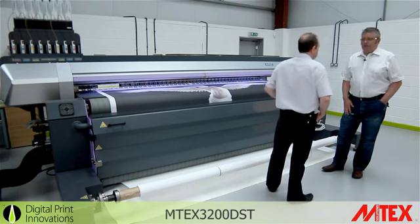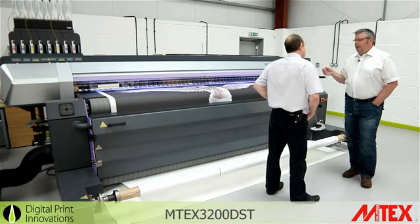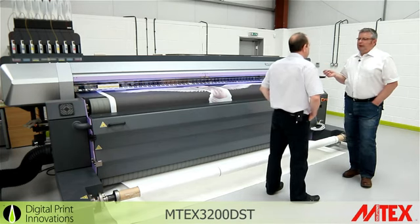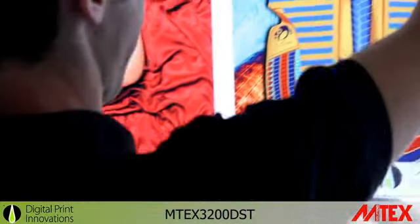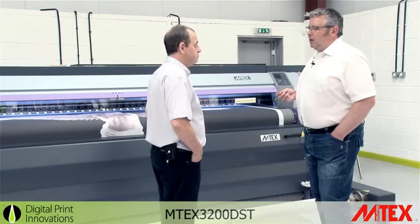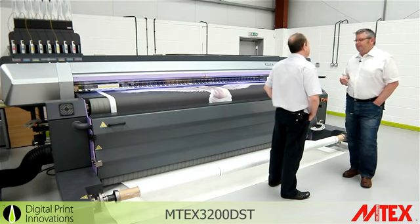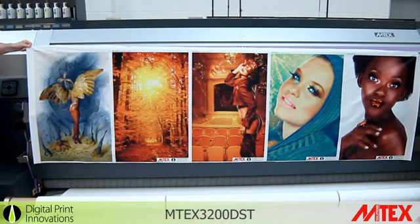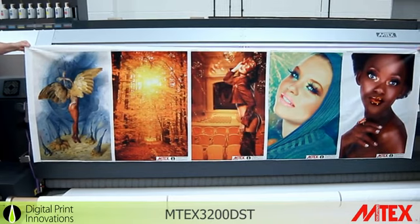So this is like ghosting effects? That's correct. The majority of the fabrics that we utilize within the machine are coated. If you're going to use the fabric outside immediately — that could be subject to moisture and rain — then we would recommend that you wash the material. The ink itself will stay as part of the material up to three years, depending on the product. For indoor applications and on certain media, you don't have to wash it at all. For instance, we have been trialing some material here which is used for 220 GSM indoor display, that we can print perfect colours on and immediately go into a light box.